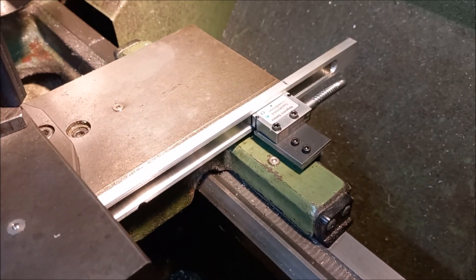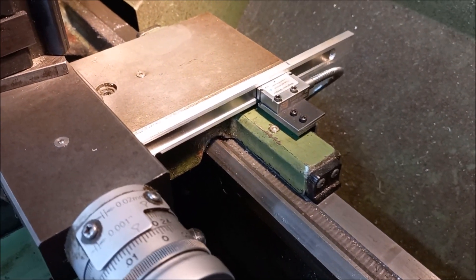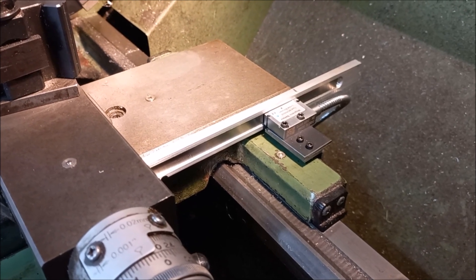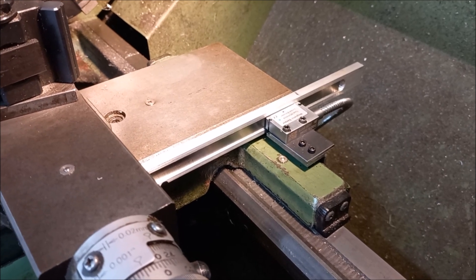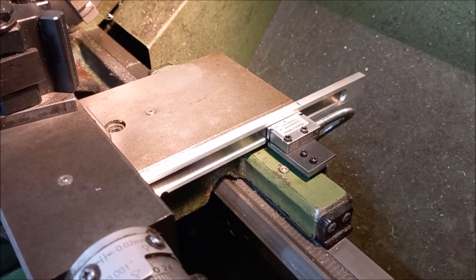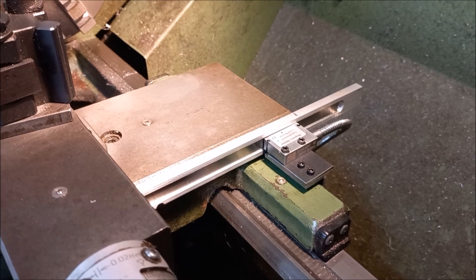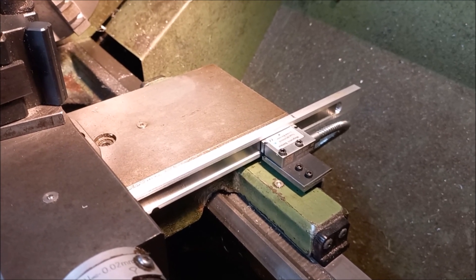I was amazed at the repeatability on this — we got within 0.03mm over 10 millimeters, which was very surprising. But I can't get over how compact this little unit is. So if you've got a small lathe and you're worrying about the amount of room that linear scales are going to take up, particularly the glass ones, these little magnetic units might be worthwhile. I'll just grab the strip to show you — you can actually cut the magnetic strip just to suit the length you want.